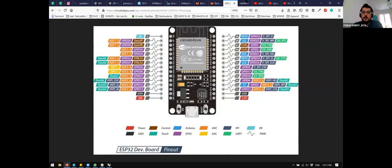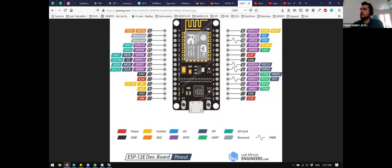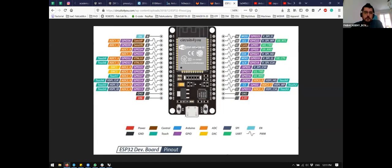What about the NodeMCU breakout with an ESP32? For example, Armand doesn't have that NodeMCU with an ESP32 — he has the ESP8266, which is a simpler version of the ESP32. The ESP32 has digital pins and analog pins; we can see the ADC labels. Most pins of the NodeMCU ESP32 are analog-to-digital.